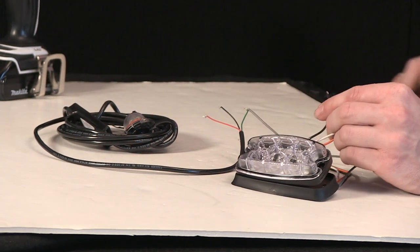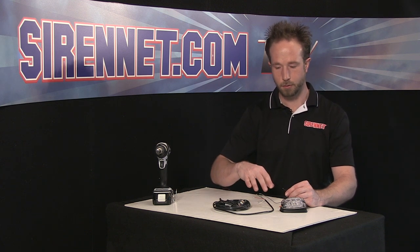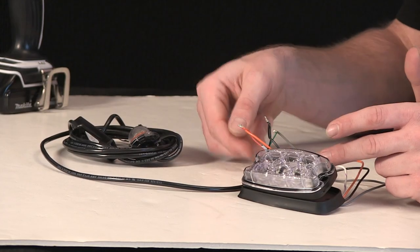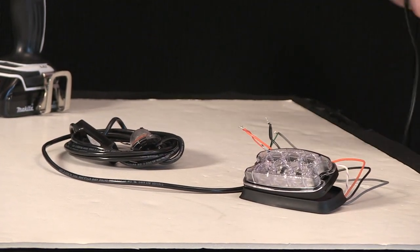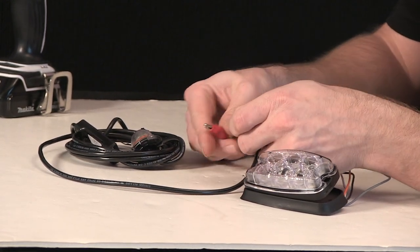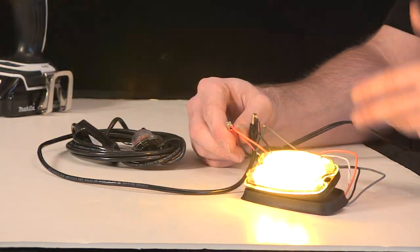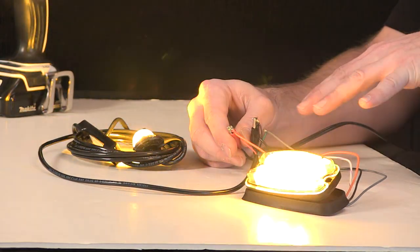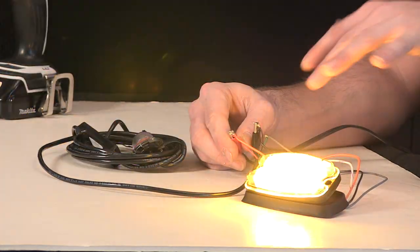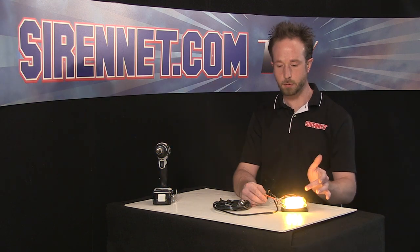So I'm going to go ahead, take the clips away, twist the wires back together — then you'll see how the phase one, phase two is going to work between the two. So with the wires twisted back together, back comes the alligator clips, and there you have it. Light heads come alive, 12 volts is applied, same flash pattern, phase two, phase one. So that gives you the alternating effect. And again, both light heads connected together through the communication synchronization wire.